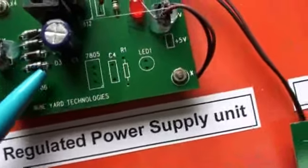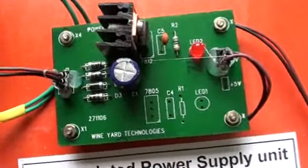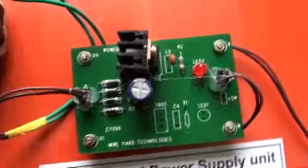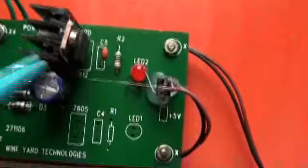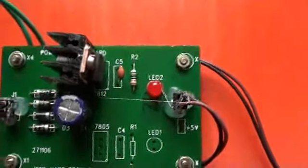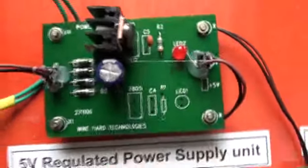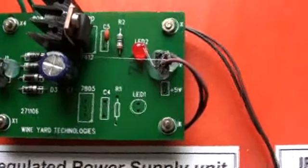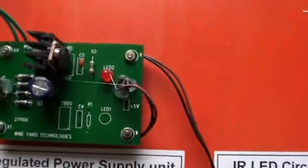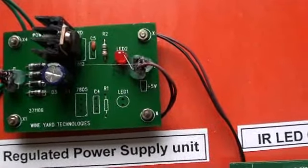The secondary is connected to the Bridge Rectifier — these 4 diodes form the Bridge Rectifier. The output of the Bridge Rectifier is given to a capacitor, which is a C-Filter. The output voltage will be approximately 18 volts, and this is given to the Regulator — a 9-volt positive regulator, the 7809. A Disk Capacitor is also used here to filter out spikes and noise pulses. This LED is an indication for the availability of the Power Supply — if the LED is glowing, the power supply is available.